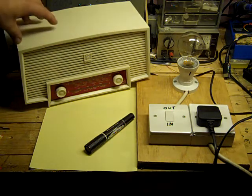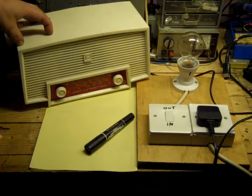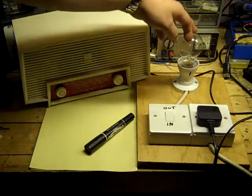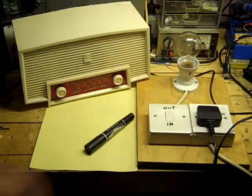These radios also have a filter capacitor across the mains, and in originals it's an old wax paper capacitor. After 50 or 60 years, those capacitors go off like firecrackers. If you're sensible you'll have cut that out of circuit already, but if you haven't and you plug it in with this device and that component is failing, the bulb will light, flicker, and flash — you know there's something wrong and you can quickly switch off again.